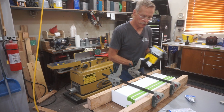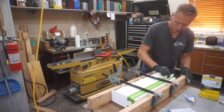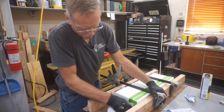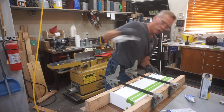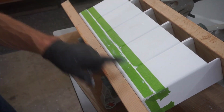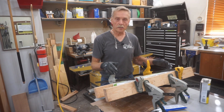And you need that even more because I'm using a little bit of acetone to kind of smooth these joints. This is kind of like tooling a caulk joint with a wet finger. But water doesn't work for this stuff. So I'll use a little bit of acetone to kind of clean up those glue beads while I can. And you can imagine the mess I'd be dealing with right now if that frog tape wasn't on there. And I'd consider that a successful glue up sequence for getting the bottom glued on to the compartments.